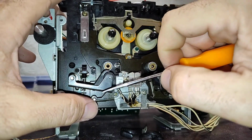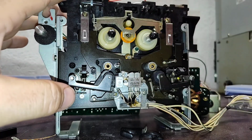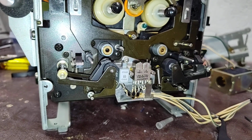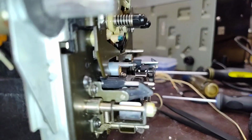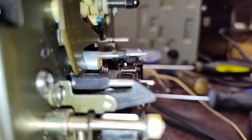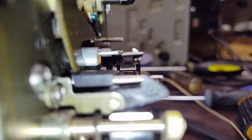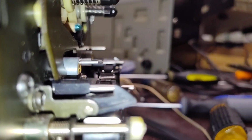Okay. And then we put our C-clip in here and we reset the height back to what it was on this guy. Alright, so I need to get the camera out the way so I can get the tools in to secure the C-clip. Okay, so we're all squared away here. Now a little pointer, if you do forget the height of this thing, this nylon washer down here, this guy right here that I've got my fingers on, you can kind of square up the tape guide with the head, and you can see I'm pretty close. It just needs to come out a hair.